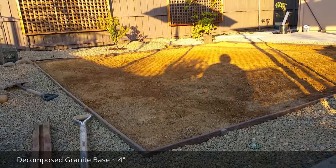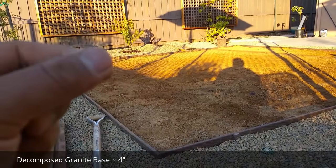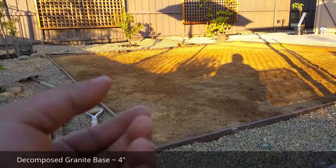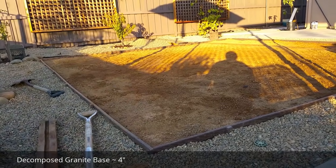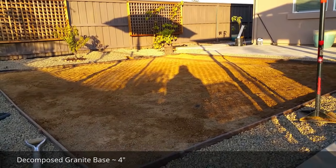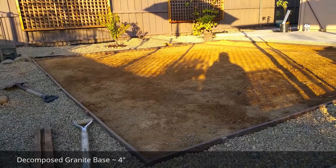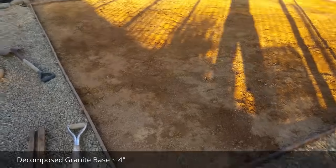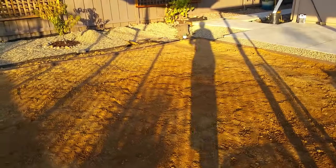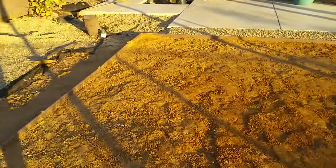It's great because I just drop it right in and staple it — or nail it, as they suggest — because the nails will actually bind rather than the staples. If the staples rust out, the tops or heads might get stuck up into the artificial turf. I got about four yards of decomposed granite, and I had to moisture-condition and compact it in place, getting it relatively level.